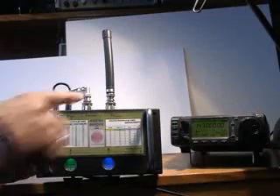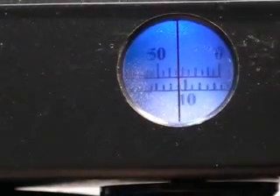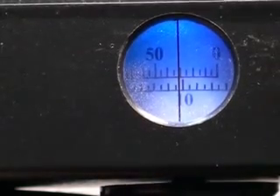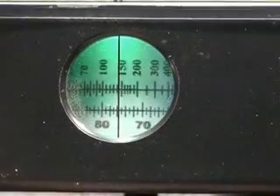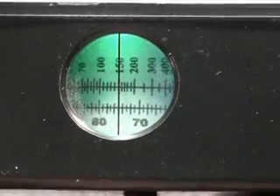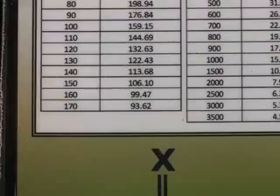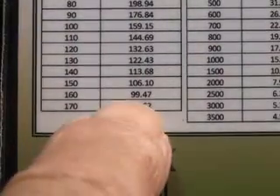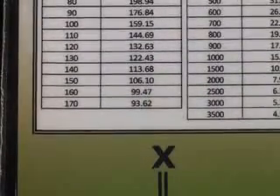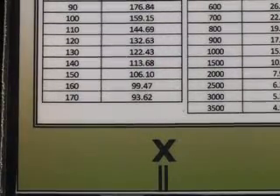This is the same test now using the Kenwood 144 MHz whip antenna. For the Kenwood antenna, the R-control reads around about 30 ohms, and the reactance adjustment is around about 150 pF capacitive. The 150 pF capacitive is a reactance of 108 ohms at 10 MHz. So at 100 MHz that would be 10 ohms, and probably about 7 or 8 ohms at 144 MHz.